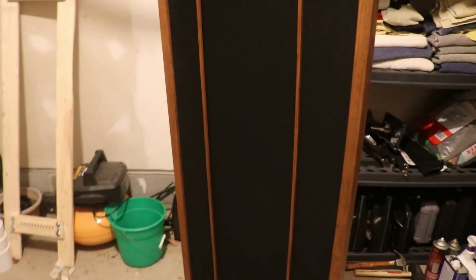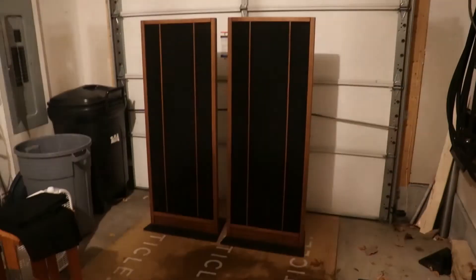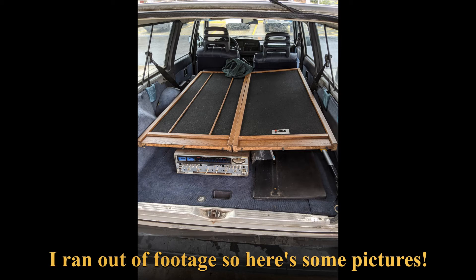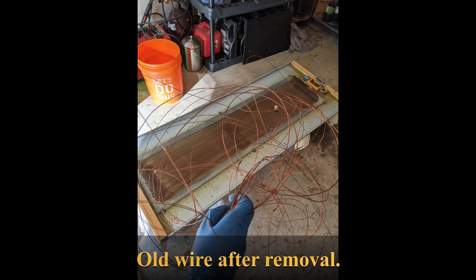And there you have it — all back together and totally rebuilt. One of my trim pieces broke free when I lifted it, but nothing a little work can't fix. If you can't get those to stay, they do look fine without them. One important note: make sure to mark the frame pieces by front, right, and left sides. You can tell if you've put it together correctly by the angle at which the speakers sit off the stand. I actually assembled it incorrectly and broke two screws before I realized the mistake, so don't make that error.